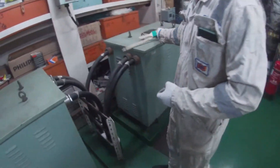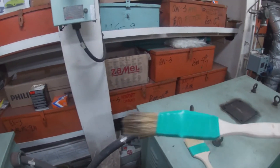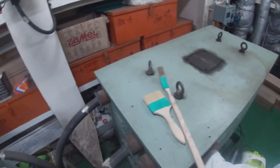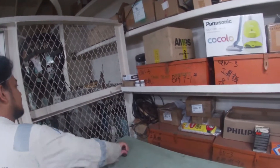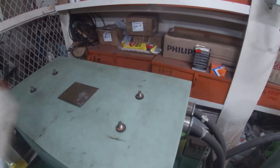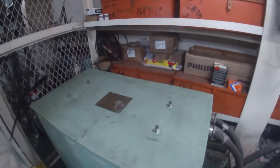We're putting tape on any metal objects on the cleaning brush because we're only checking the situation and looking at what it's like inside. The brush has metal, so it's important to tape it for safety. We always try to be safe when working in a dangerous scenario. This is a 440-volt system. In other vessels they have 6,600 volts, which is very dangerous. We have to be careful not to let any metal objects fall into the transformer.